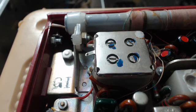And I bought radios on eBay where somebody sprayed the band switch. And I showed you, I had to go in that band switch every day and clean maybe 4 or 5 contacts and work my way along, and it all started working. But what happens over a period of time, that copper in all those contacts, it's going to go black again, over like 5-6 years, and then you're gonna have to put the radio on and wiggle it back and forth. And a lot of people, they just spray it again, and that's the problem with old tube stuff. A lot of the selector switches are brass or tin-plated brass and sometimes copper, and it goes bad. And you're like in there again.